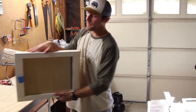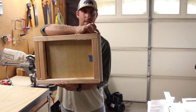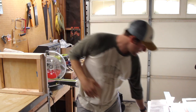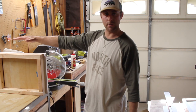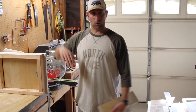And then on the trim, as you can see right here, I overset it about 3/4 inch because that's what I'm connecting these two frames on either side of the benches, and it'll be with 3/4 inch ply. So that's totally strong enough. And then run the top sheet of plywood over the top, and then we're gonna make doors with the same piano hinges.